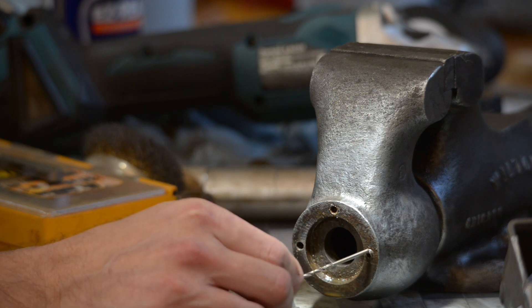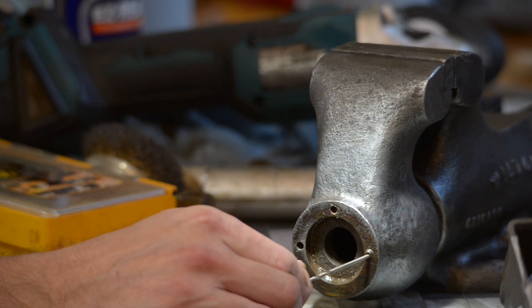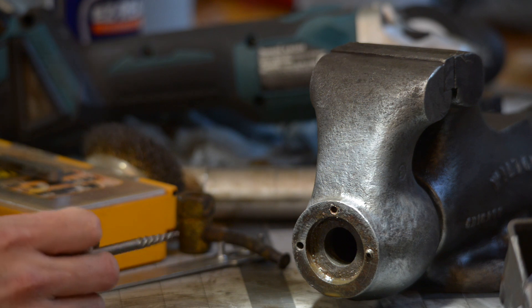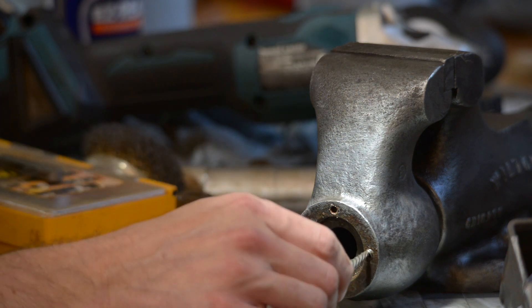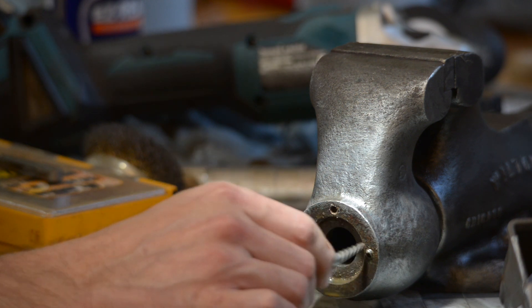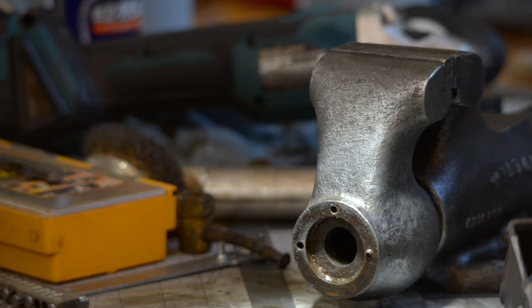The rest of the second screw has been removed, with the stub stuck in back there. The third one - the head of the screw is still here. You can see where I've drilled it out a little bit last year. I tried using the screw extractor to remove it but didn't have much luck. I can't find that small screw extractor, only this big one. I don't know if it's going to get any purchase. I think my best bet is probably to re-drill and tap them.